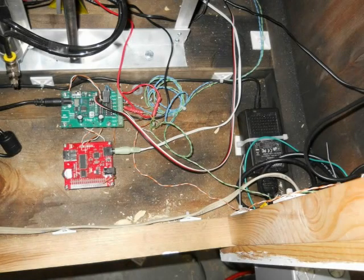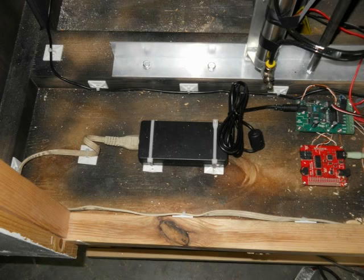This shot shows us the controller — that would be the green board on the top there, you can see the Prop 1 logo on it. The red board at the bottom is the MP3 playback board; that's what provides the sound files. There's the ribbon cable there. The black, red, and white cable goes up to the motion detector. The black and red wires towards the top center drive the air solenoid. The power supply tied down to the bottom right powers the motor, and off to the left is the power supply which powers the circuitry and electronics.